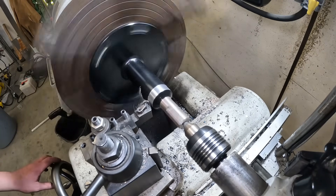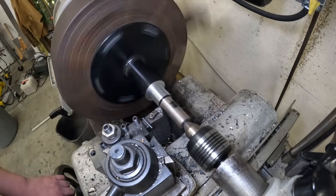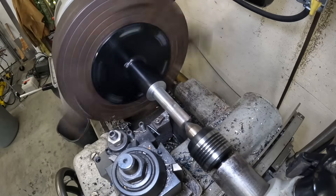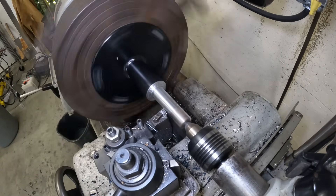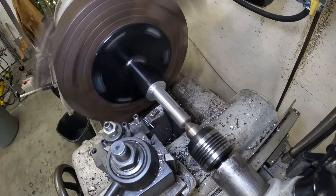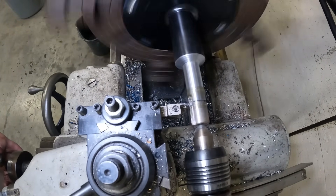It is time to switch gears. This is the shaft that connects to the flywheel of the engine, and on the other end it goes into our jaw coupling which connects to the hydraulic pumps. When I originally made this shaft I didn't really know the style of coupling I was gonna be using, so I sort of just roughed it out. Turns out I'm using a much bigger coupling, which just meant we had to turn down the outside diameter a bit more — it's a lot easier to remove material than to put it back on. Then we parted off to the correct length and that's the lathe work complete on our little drive shaft.